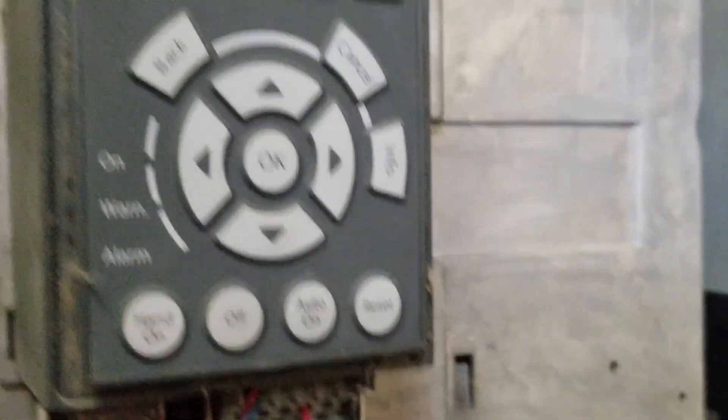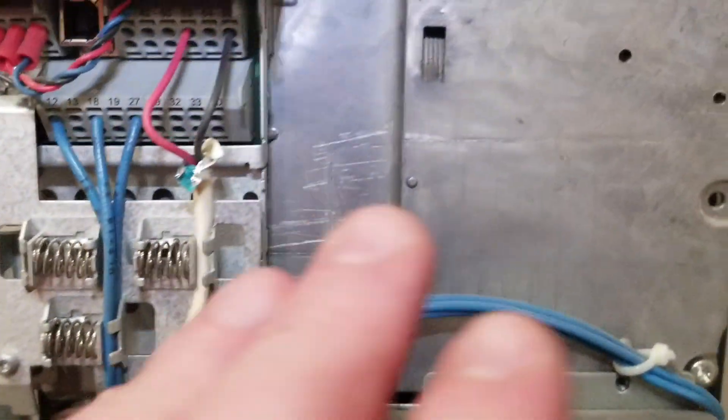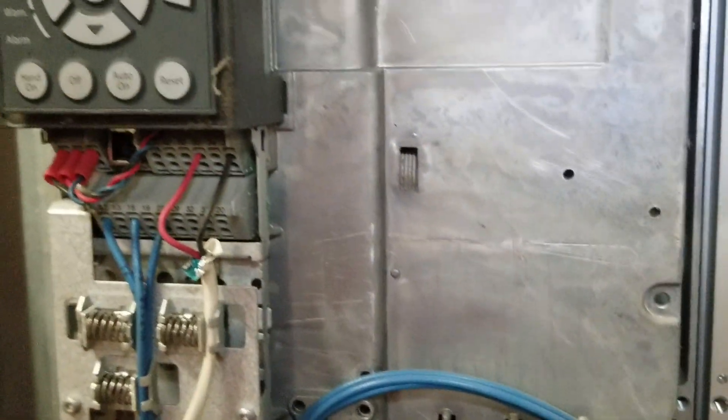The other thing that I do not like about it is the location of the auxiliary relay wiring. It is buried down in the drive — there the relay is, buried behind all of this. If you are trying to do any testing on the relays, it's going to be virtually impossible to do so just because of the location of the contacts. It would be much more helpful if those relay contacts were somewhere exterior of this to where you could actually do some testing if necessary.